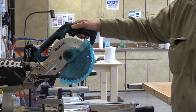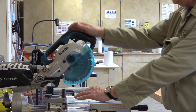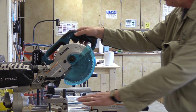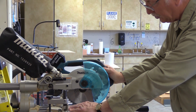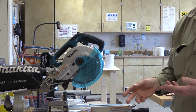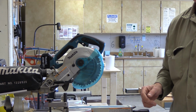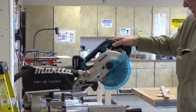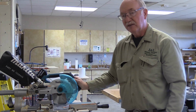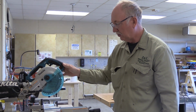The other nice thing is they have radial arm saws that used to draw through the stock. Well, if the blade is turning this way, and the saws are very powerful, probably 5 horsepower or more, you start drawing the material through, it would catch and rip it forward. Sometimes it would blow the stock out through the back of the fence, or it would jerk the stuff so hard it would pull your hand into the saw blade. Whereas now, the saw comes down and if the blade is spinning this way, you're pushing the stock back into the fence.